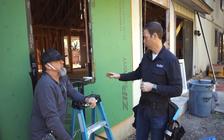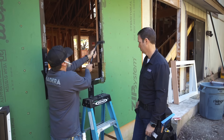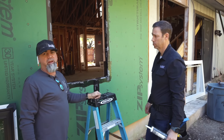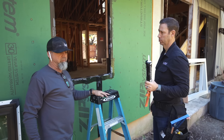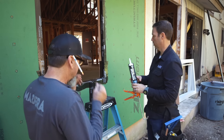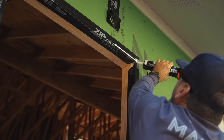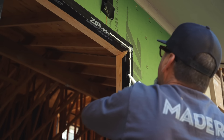The color on the frame is actually through it — it's not just a topical paint — and every single window they make is PG 35 rated or better, which is a rating of how well it resists wind and water coming through the frame. Now we need to prep the window with caulking on three sides. I prefer to put the caulking on the sheathing itself rather than the window, so you don't have to put your fingers in it — sit the window on the sill and push it into place. We're going to use DynaFlex Ultra and run that in a U shape. This is just belt and suspenders, making sure if something were to fail on the flashing tape.